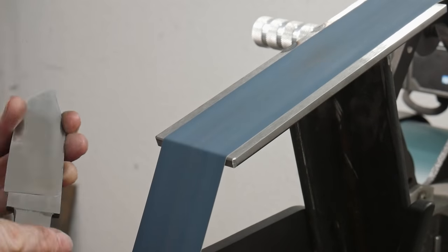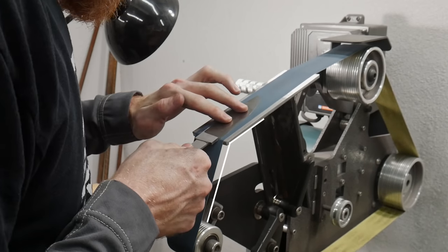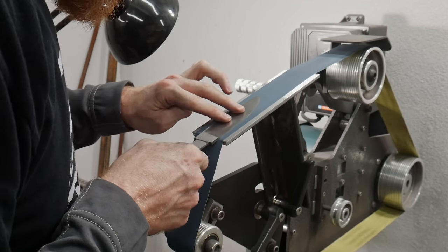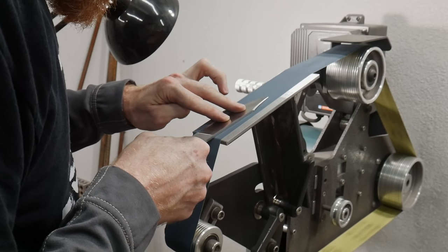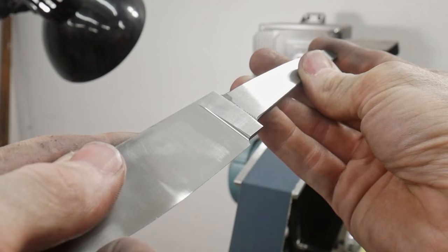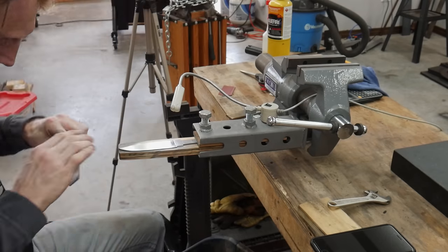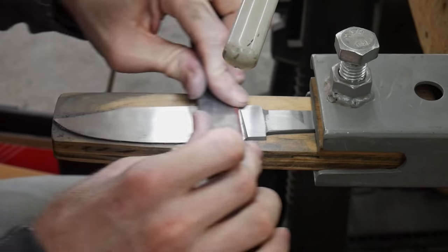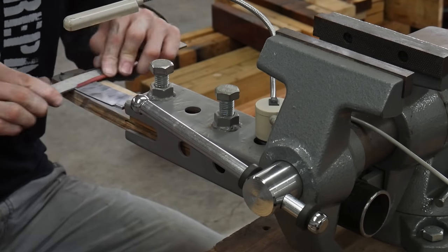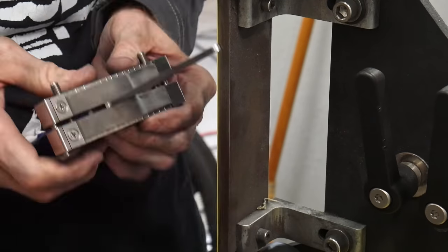One thing with waterfall platens is the belt bump going over the face can be fairly severe, so you want to run them fairly slow and stand to the side in case the knife tip gets caught. When grinding on this platen I used a fairly obtuse angle off the radius face, though I've seen people use a more acute angle so the belt goes under the platen — I'll try that in the future. I also think that angle allows you to use a file guide against the belt for easier symmetry. Once the plunge lines were symmetrical and the blade ground to 320 grit, I brought the whole blade up to a 600-grit finish.